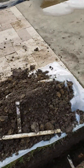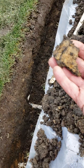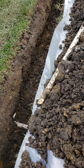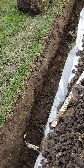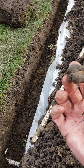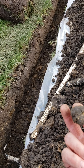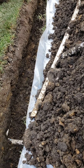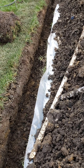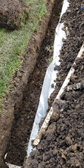Because a lot of this soil is very, very clay heavy, we're not going to backfill on top of the boards with clay. We got some good quality topsoil that we will backfill on top of the boards. Here's the thing — you can't expect the boards to do their work, to do their magic for rainfall, if the water can never get through to the boards. So we can backfill on the sides of the board with the dirt we excavated, no problem. But when we have clay, we bring in either sand or topsoil, some kind of a good medium that actually perks — that the water, the rainfall, can get through to reach the boards.